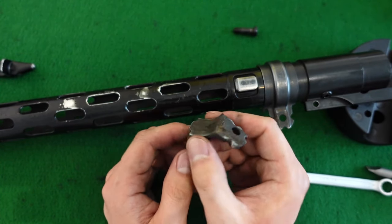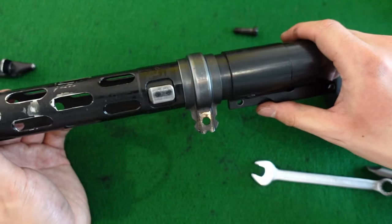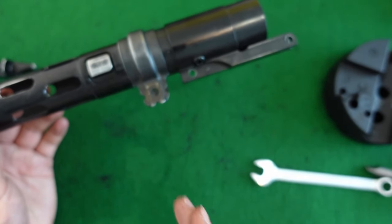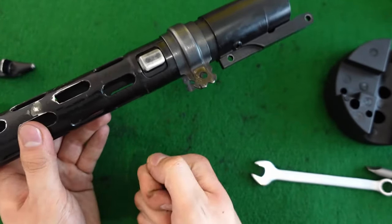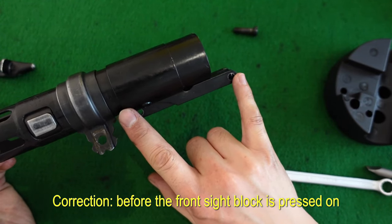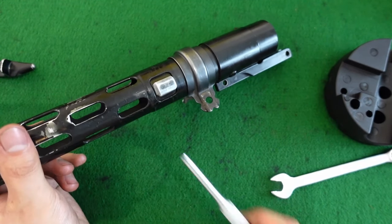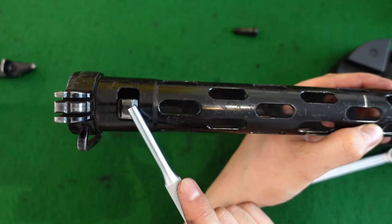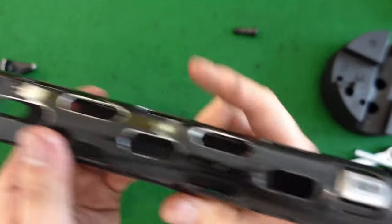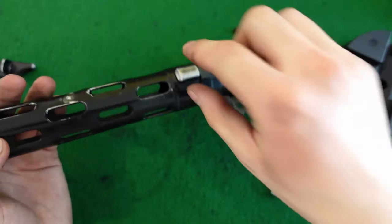You can see that the bipod bracket basically stays on the jacket and cannot come off easily. If it is defective, a standard armorer practice was allegedly to use a pair of levers with slots to simply open it up and remove it from the rear. In reality this thing is assembled before the jacket connector is riveted on, so it's not actually intended to be bent that way. The jacket assembly has a couple of riveted assemblies — the rear and front bipod catches, which are C-shaped springs riveted opposite to the catch with a pop rivet. If you want to replace the catches, you would have to drill the rivets out and remove the defective catch. The front sight block and bayonet lug is one integral forging, finish machined and swaged onto the jacket with a barrel bushing as a counter nut, consolidated into one single part. That about wraps it up for the jacket assembly.